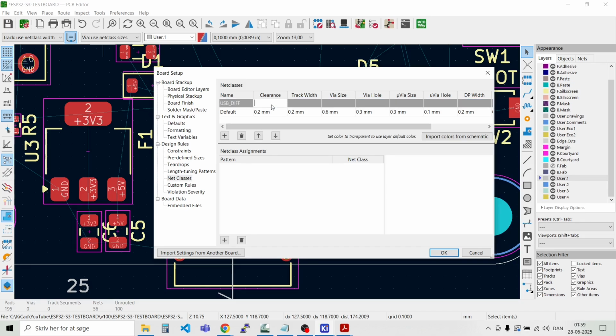And normally you would have like 3 times the width of a track, and that was 0.22 millimeters or 0.24 millimeters. So we can just say like, for me it's good with 0.6 millimeters. And the track width was, we can just say that's 0.2. It doesn't matter because we have to change it for the differential pair here. And the width was 1.15, and the width was 0.24 here, and the gap between the tracks was 0.15, like that.